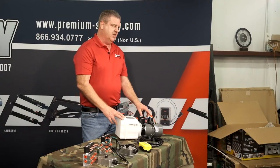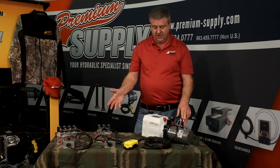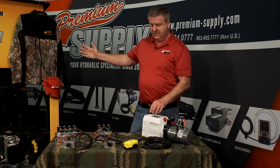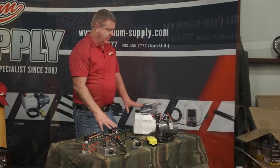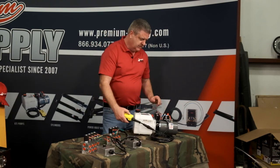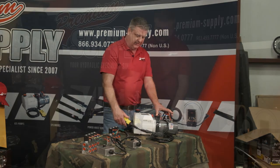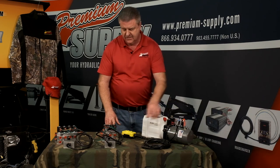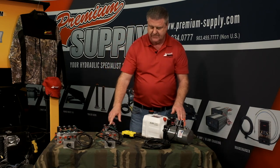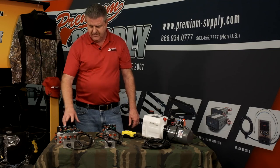This is a KTI pump — this is the most common double acting circuit for a single cylinder circuit. So if you have this on your trailer and you want to add more circuits — say you want jacks and a dump, or even a hydraulic door on the back of the dump — this selector valve allows you to have three individual cylinder circuits based off your standard double acting pump. Typically when you hit the button, you're energizing the starter solenoid for the motor, getting it running and shifting a valve — so you're asking two valves to energize. When you hook the selector valve here, you get three valves energizing, and with this switch you can select one circuit or the other. This larger unit does exactly the same thing except for four cylinders — so if you've got four jacks and want to individually work them, that's how you do it with your selector valve.